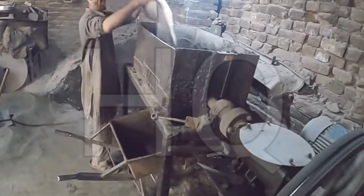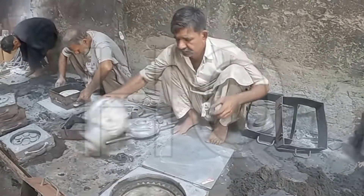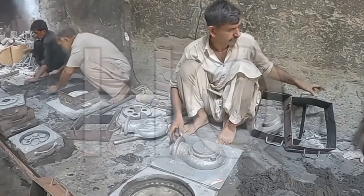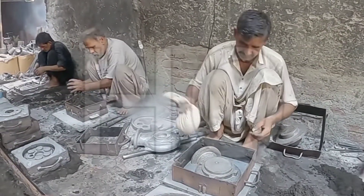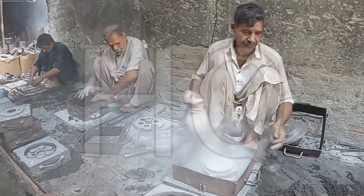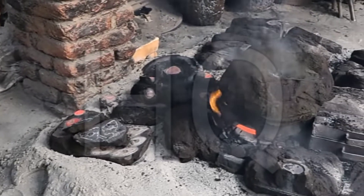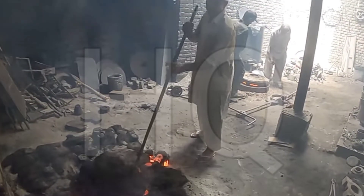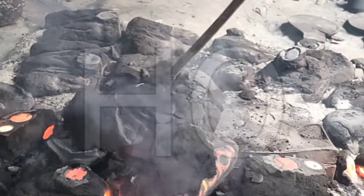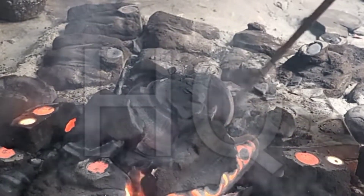The other process uses dark molasses mixed in sand. In this case you can see the process — a pattern is used for molding sand, and after that the pattern is removed from the sand and then pouring happens. So this is the other process of alloy casting.